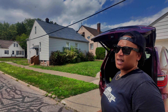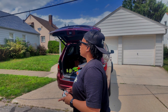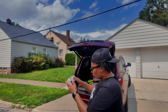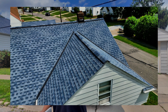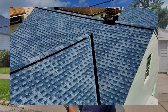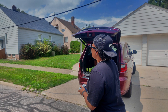The next thing I'm going to get is my ridge. As mentioned, this is a gable roof so we got a continuous ridge. On this particular roof, we have ridge cap shingles installed, so I want to take a look at those ridge caps. I also have here in the front a dormer — remember we talked about dormers. So I have a valley here, and this particular valley has a continuous piece of metal flashing installed. I'll take shots of both of the valleys as well as the dormer.